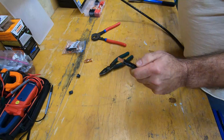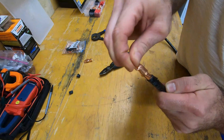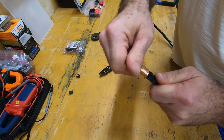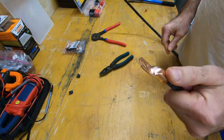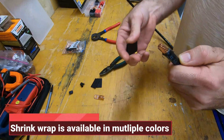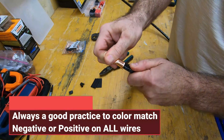I'll give you a quick display of a 1 AWG wire and a 2 AWG lug — it almost fits, and you can try a vise and everything else to get it on there, but it doesn't work. So you definitely want to put on your 1 AWG lug and get it fitted on. In this case we don't have to worry about direction since it's the first end. We do, however, want to put on our shrink wrap ahead of time — if the other end is already on, the shrink wrap won't fit. So we'll put it over the top first.